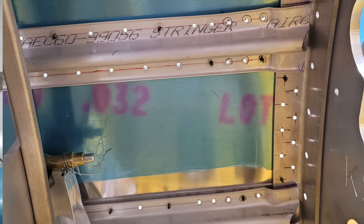So the skins were on — that was a big thing. With the skins, you have to fit the stringers, and there's a substantial amount of stringers here. They run from the transport joint all the way up to frame A, and then they're broken at frame A and start again between A and the forward ring. So there's really no proper connection between any of the stringer segments forward of frame A — they're basically floating in there to make the skin more rigid. The stringer sections between frame A and the transport joint are connected at either end. At the transport joint they're joggled, so they're basically bent up and over the thickness of the transport joint and rivet to that.